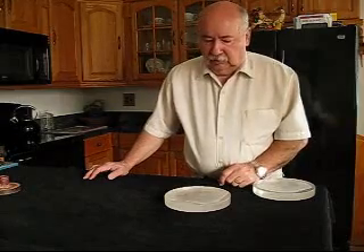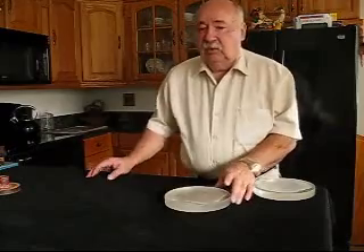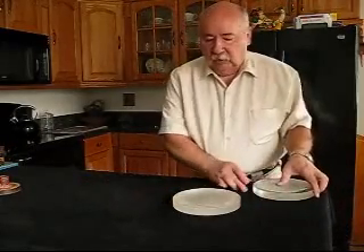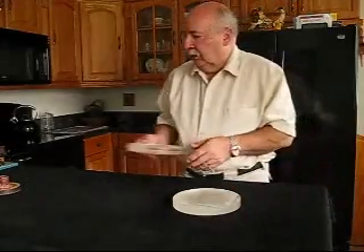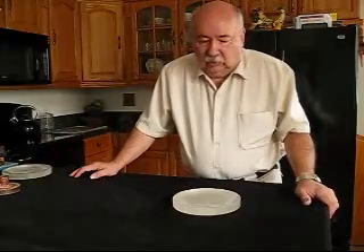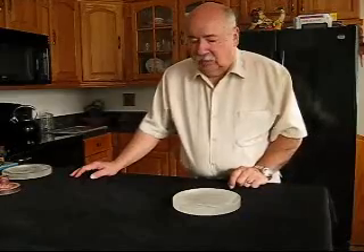The things you need to do: you want to measure the curve and know what the focal length is, and you need some way to measure the radius on it. The radius is twice the focal length, so you need some way of measuring.